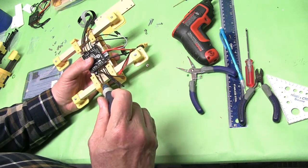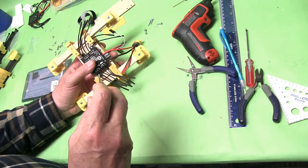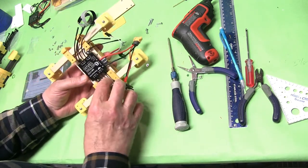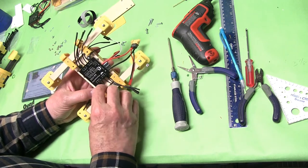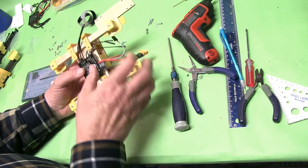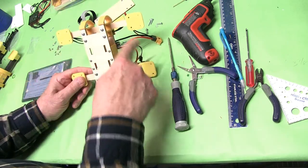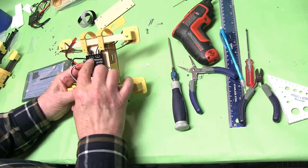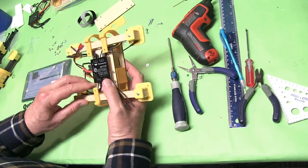Make sure your wires are aside. Then you can put the other two screws down. That's done. You want to make sure that you run these three wires to each motor — don't cross them up. Three wires for this ESC, and each ESC goes to its respective motor. This is going to be motor number one, two, three, four. Actually, this is motor number four, and motor one is over here — we're going to fix that in a minute.